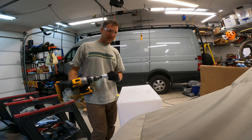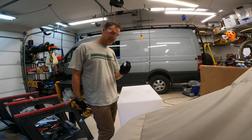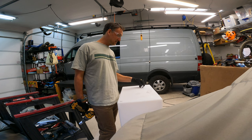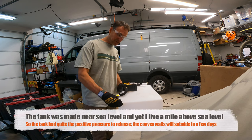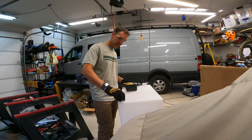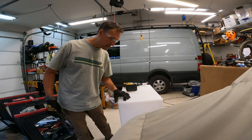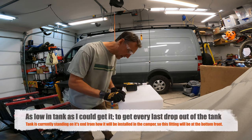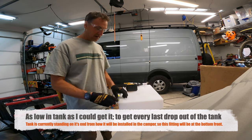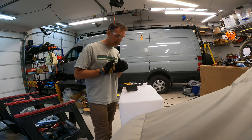So much air pressure came out of there — it just burst right out at me. I should have probably drilled a little tiny hole first. All this air just came gushing out, kind of smelly air too. That's the joy of popping a hole in a pressurized tank for the first time. Let's check our fitting. That's beautiful — it looks like it's just perfectly placed, as low as we can get it in the tank, barely a lip there. That is great, right in the corner where we want it. Now we've got to spin weld this on.